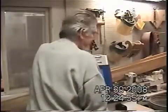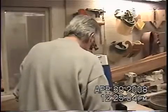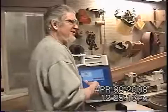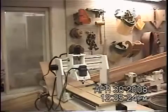It wasn't loaded, so it kept getting near it. Okay, now it popped back up to bright green. Now that part is loaded in. When I'm setting things up, I always like to go to jog. Everybody who's ever played with one of these things, you can look at the pad and you tap the go code. I don't want the go code to go. So I always put it on jog when we're going to put a router bit in there and set up a board on here. While I'm doing that, I'm going to plug the charger back in and keep the computer plugged up.